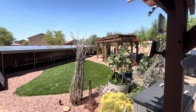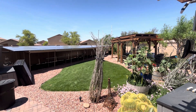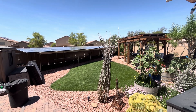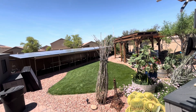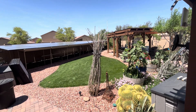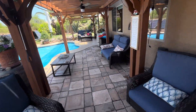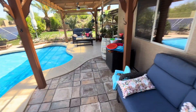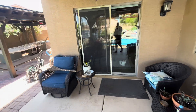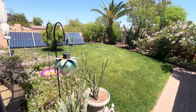Right now we're running our AC and thermally cooling the house until about 5 o'clock in the afternoon — getting the house down to about 64 to 66 degrees upstairs, downstairs, and in the garage — and then we turn the AC off. We don't run it again until about 8 o'clock the next morning, and it's usually about 68 to 72 degrees by then depending on the area of the house. We actually cool the upstairs more since there's a lot less room upstairs to cool than the downstairs.